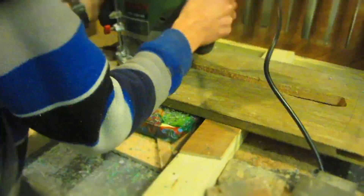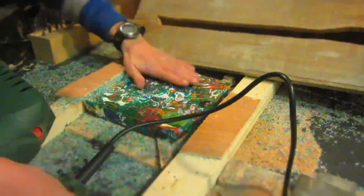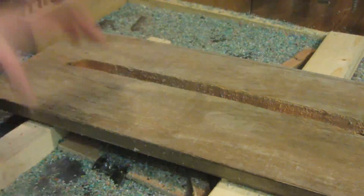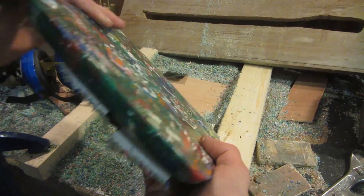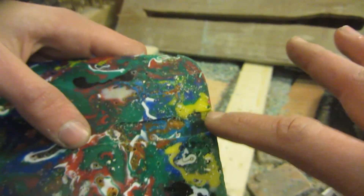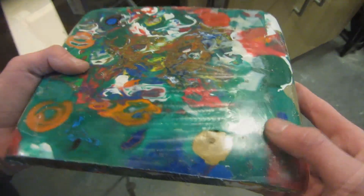I experimented with a couple of different methods and found that instead of moving in a random motion, it's much better to move from right to left, go back to the start, and repeat — slowly removing material in one pass. After peeling it off, the surface was actually really smooth and flat. There was one small slip in the corner where the guide slipped off, but I could easily fix that with another pass. I also flipped it over and did the other side — since the surface was now flat, no shims were needed — and both sides came out flat and smooth.